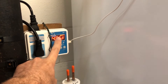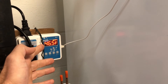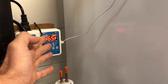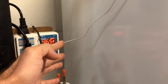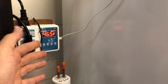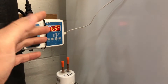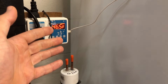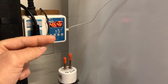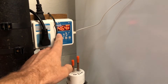Because of that, this thermostat needs to be set to turn the chest freezer off when it hits 32 degrees so the water doesn't freeze solid. You could potentially cool it down colder using a freeze-resistant fluid if you want, but the colder the fluid you pump through the heat exchanger in the room you're trying to cool, the more condensation you're going to have, and it could clog up the little holes that the airflow needs to go through.